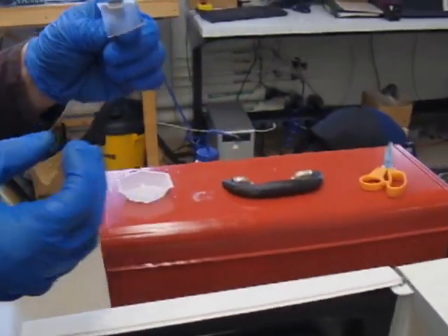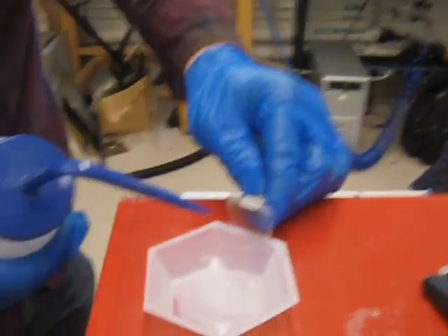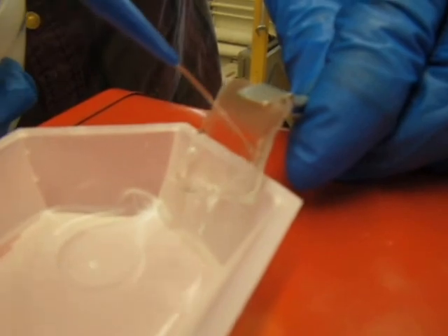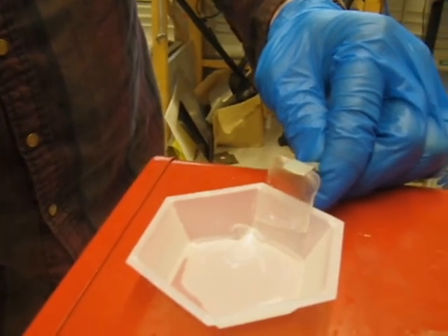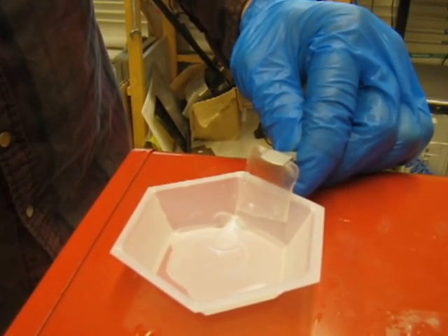This is the side that was exposed to the plasma. Now we're going to do a bead test on it. The water easily runs off it, showing that the surface has now been coated with hydroxyl groups and is hydrophilic instead of hydrophobic as before. That's not too bad for a microwave oven and a vacuum pump.